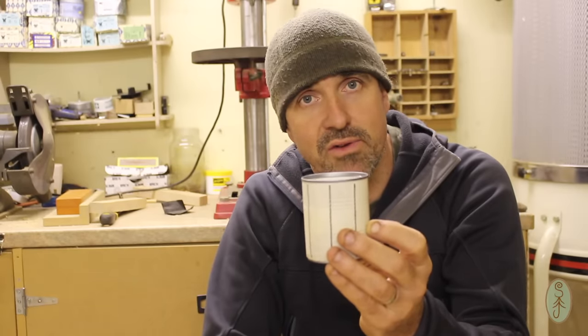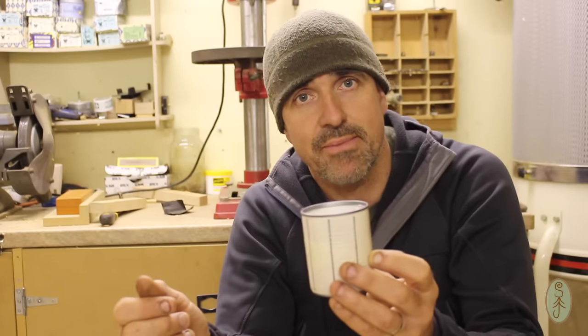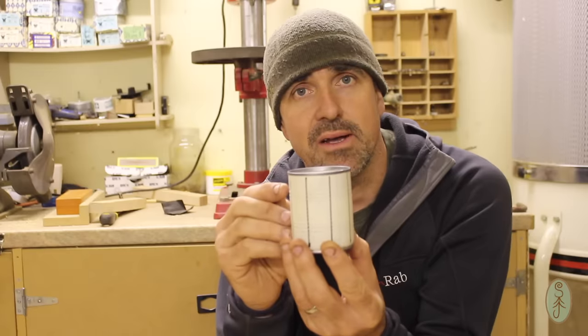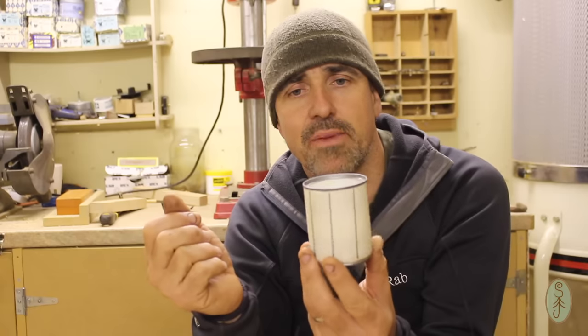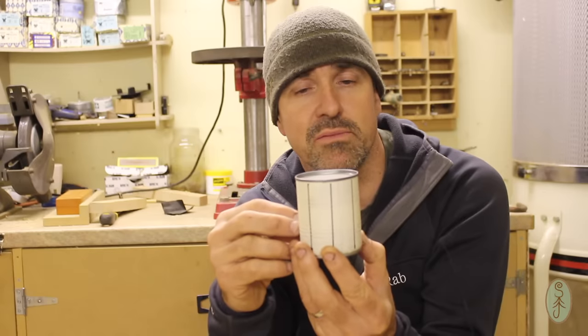And that's how a wood gas stove works. Gases are given off when wood burns, but normally they're just lost into the atmosphere and wasted. The idea behind a wood gas stove is that they're burnt. So you get a secondary burn going on. It's a much more complete burn, so you have less smoke. Much hotter, much more efficient. So that's how it'll work.